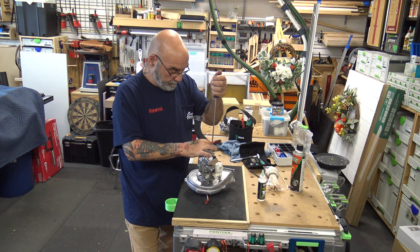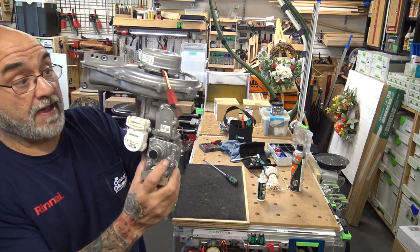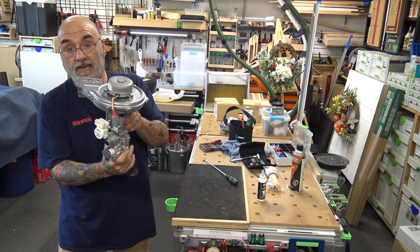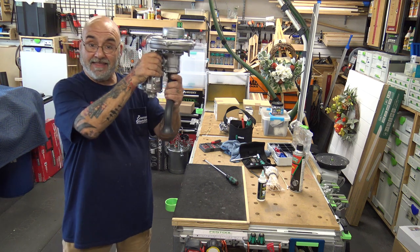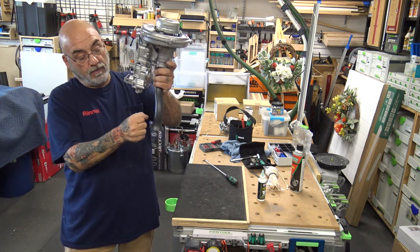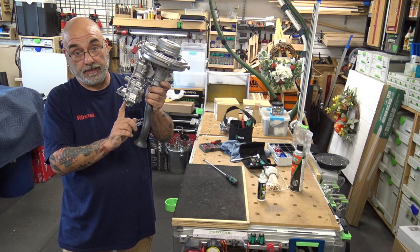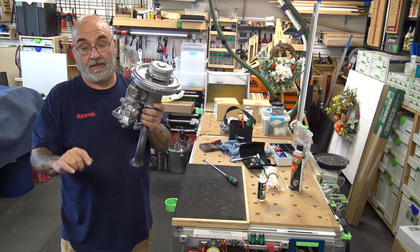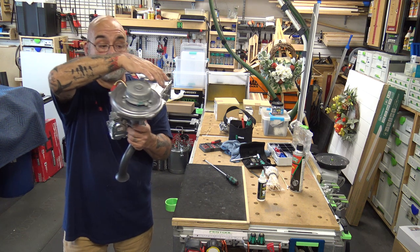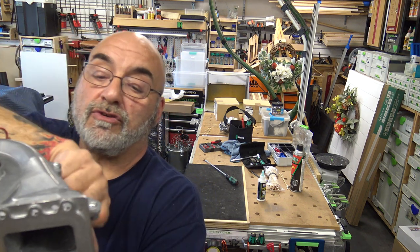All right, so everything is tight. Again, make sure that your plug is in the gas valve, and now you're back together, whether you cleaned it or you replaced it. And now you put this back in the housing. But before you put these screws in, again, go back to my video and look. I always put the gas in first. There's a lot of movement with the gas, but I like to get the gas in first. Then catch those first, nice and loose, so that they're aligned. The two alignment pins align up, because these are the two alignment pins right here. This one and that one. You got to screw, screw, and screw.